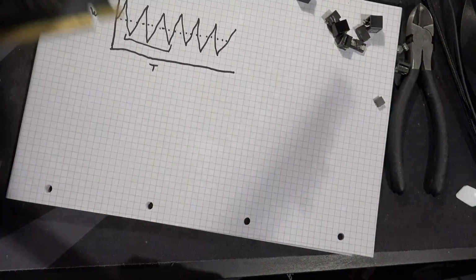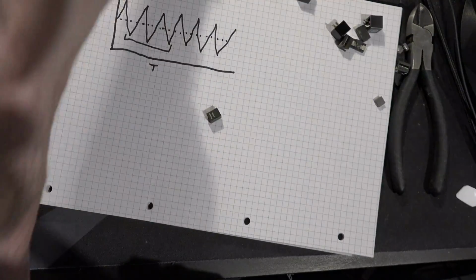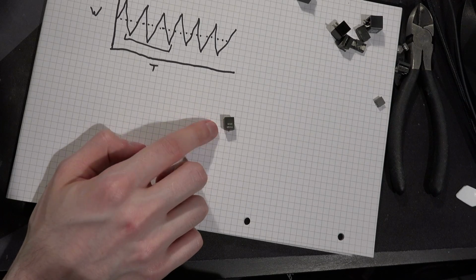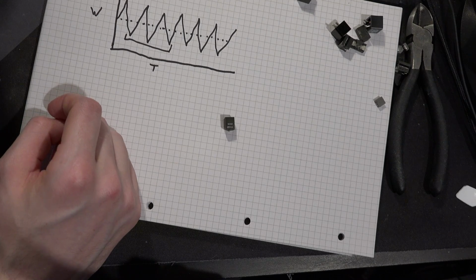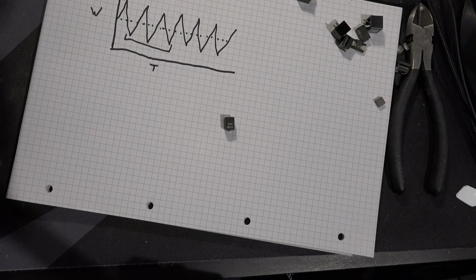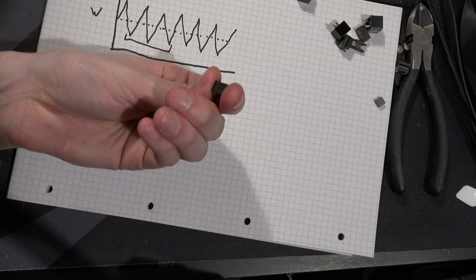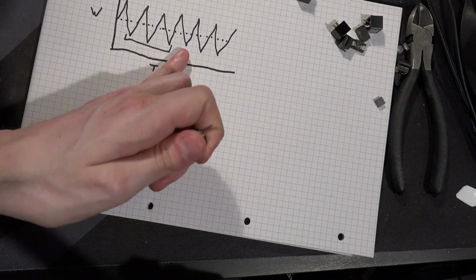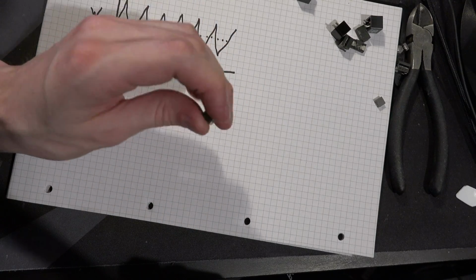But if we're looking at modern GPUs, newer GPUs than this, then this style of inductor is really, really popular. And these coil whine a lot. So yeah, that's basically all I have to say. GPUs coil whine because they use a style of inductor that, while electrically really, really good, acoustically lends itself really well to being a bit of a speaker. And unfortunately, because GPUs load cycle really hard, you get a bunch of coil whine as your frame rate goes up and down.